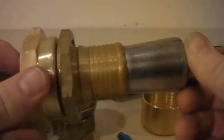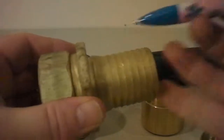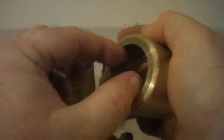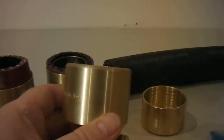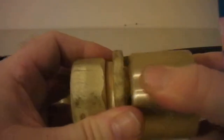The way this works: this goes inside the fitting, and the machine pulls this whole little plunger all the way through. When it does that, it expands this brass piece right here. In the bad fitting, as it expands, it's getting hung up on the collar because the collar doesn't seat inside the groove. So it applies too much pressure and when it expands it pops the brass, cuts it, and breaks it. There could be two reasons: maybe this ridge is too thick, or maybe this gap isn't wide enough.